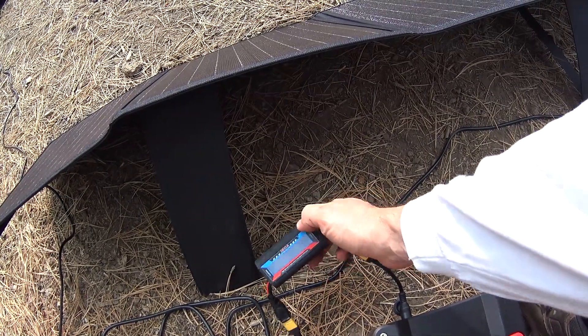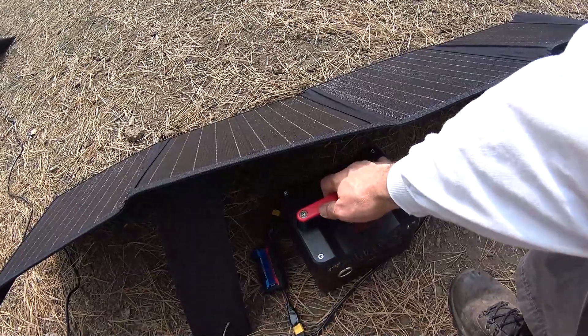So this is exactly why I always say to over-panel. A 100-watt panel, if it were delivering 100 watts all the time, would be great, but they don't. You're at the mercy of whatever the sun is doing. That's why I always say 200 watts is really the bare minimum, in my personal opinion, to get anything done. A 100 watts on a great day you'll get some stuff done, but on a day like this, you're not charging squat.